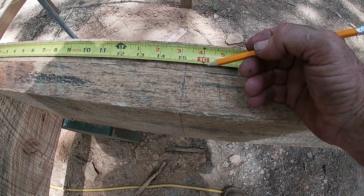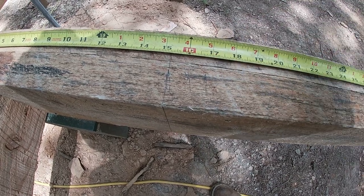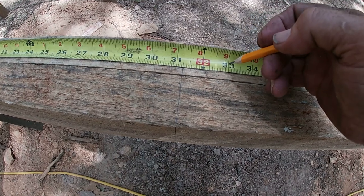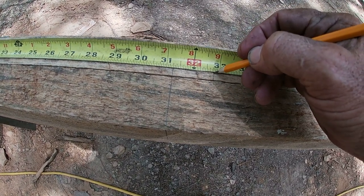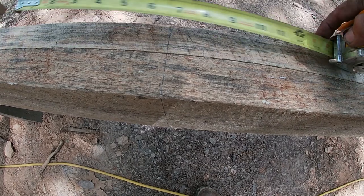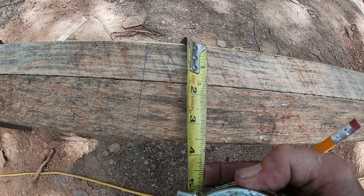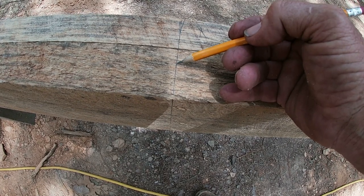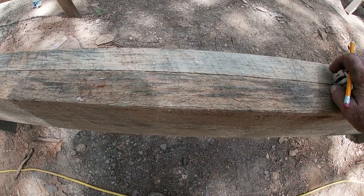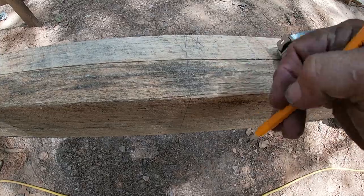This is kind of how I do a layout: there's the center of 16 inches, and I came back three quarters of an inch and made a mark, and on every mark I just set it back three quarters of an inch all the way down through there. Normally your framing joists would be an inch and a half, but these are different thicknesses — this inside piece is a full two inches and the outside is about an inch and five-eighths. So you just have to work from one side and make sure that one side is on the actual layout line, and the extra thickness will be over on the other side. Since I do have the layout I can keep them all running on a 16 inch center from that mark.